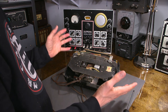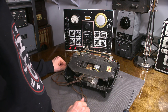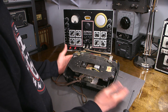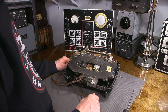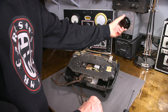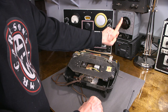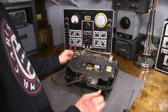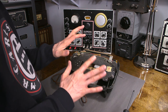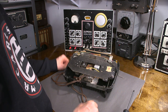I'm going to bring this thing up on a current-limited isolation transformer and Variac supply. What's going to happen is I can monitor the amount of current or wattage this thing is taking, and if anything is out of spec I can immediately shut it down. I can also bring the voltage up nice and slow on the Variac. There's a little watt meter up here. I'm very interested to see if the thing is even going to start up - I'll bring it up very slowly to make sure nothing goes haywire.